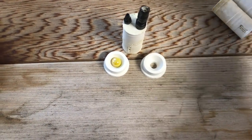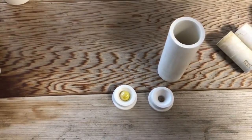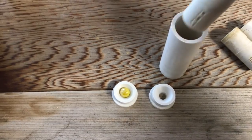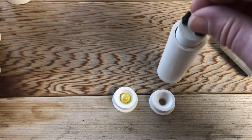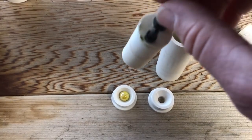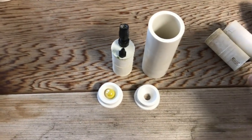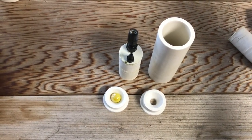This works quite well. Over the design iterations, I went from using a one-inch PVC pipe as the side of the airlift pump to designing a pump that would fit inside of a one-inch pipe. This was really good because it facilitates keeping the pump vertical. This pump works extremely well when vertical and doesn't tip one way or the other.